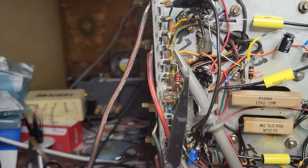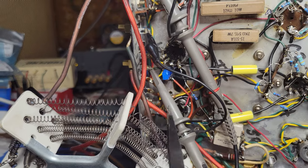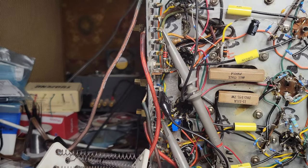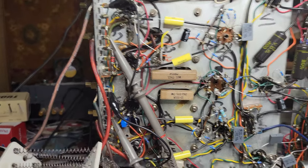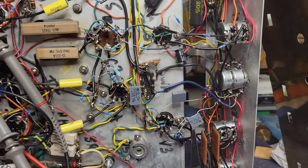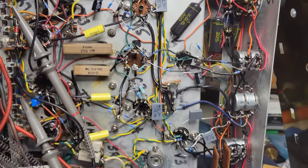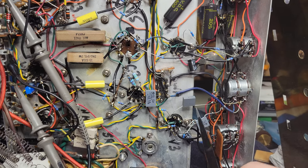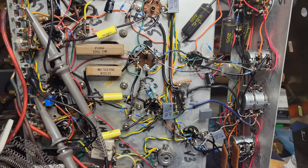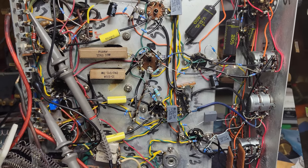There's these ancient 68 picofarad capacitors in the feedback network. Their values tested fine. That would be a likely candidate for replacement. That's maybe a good place to start. And perhaps other places. I've replaced these capacitors, but not the other. And I didn't replace the others because after I took these out and put them on the meter, it seemed to be just like perfect. But I haven't compared ESR values, so it may be that those need to be replaced.